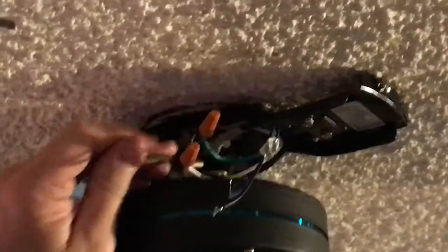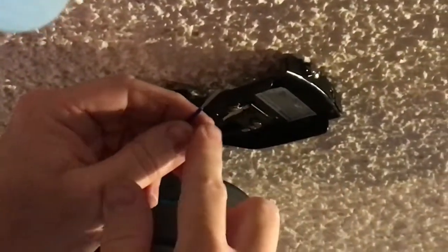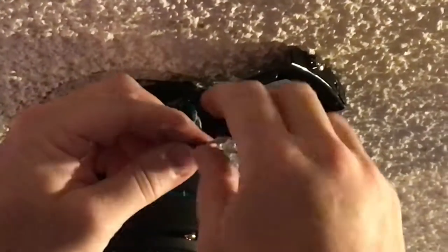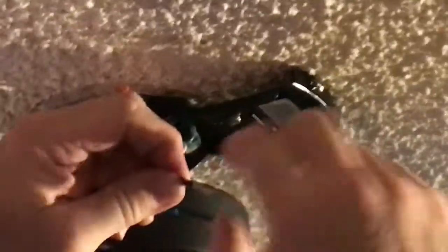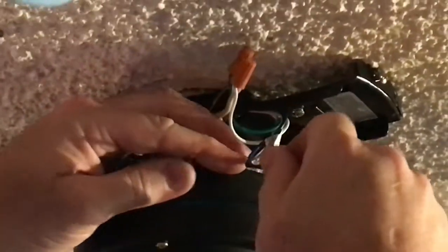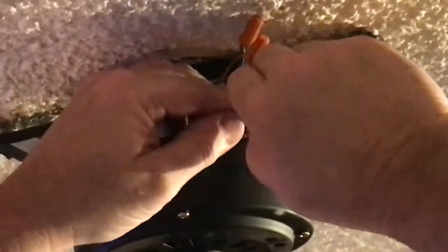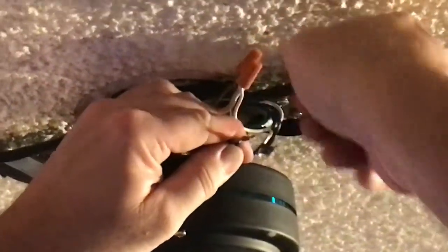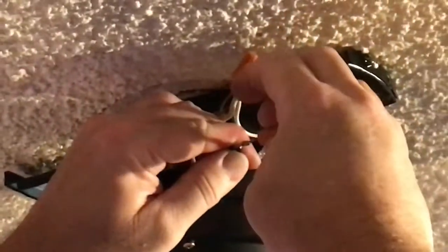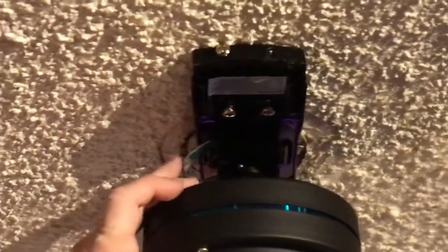For the last connection — the hot black wire. From the motor we have the black wire that runs the motor and the blue wire that runs the light fixture, both 18-gauge stranded wire. Twist those two together clockwise, then hold them up against the black supply wire, wrap clockwise, and install the wire nut. That's all the connections that need to be made. After that, tuck all the wires neatly back up in the housing to make sure they won't rub against the fan motor.